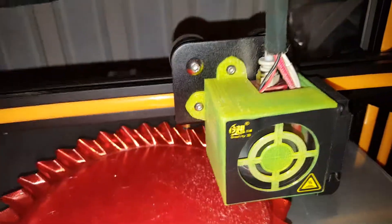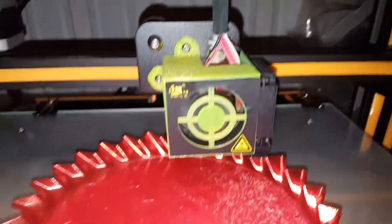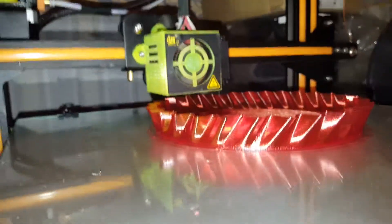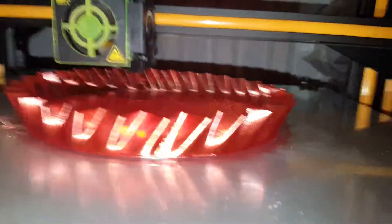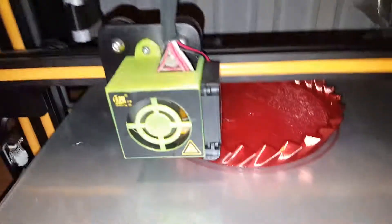Obviously printing slower anyway but I'm printing way too slow at the moment — this is down about 30mm/s I think. In vase mode it's really good, it looks brilliant from the outside all the way around. There are no flaws with it at all other than that fluffy issue, which I'm pretty sure I've sorted out now just by changing that on the fly. So the next print I'll start off by adjusting that.